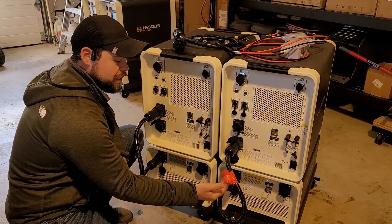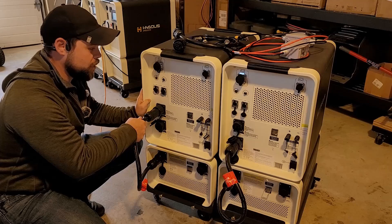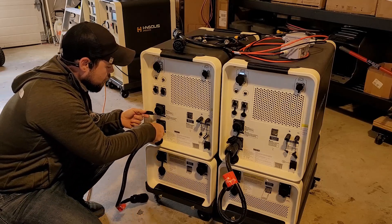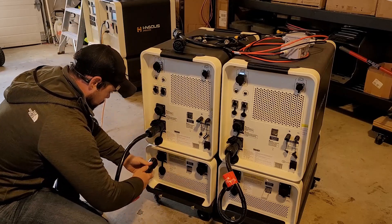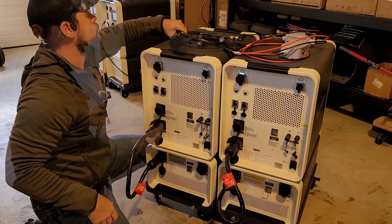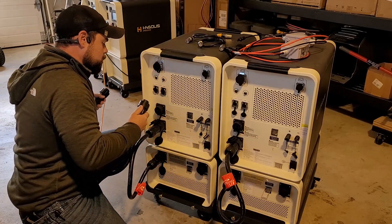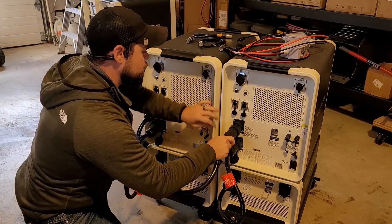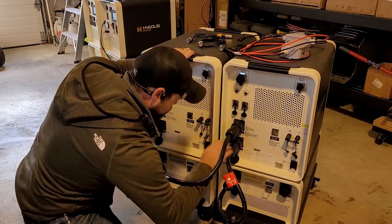I've got my battery cables which have the red tag. I'm going from battery port two to battery port one. On this unit which I previously had set up for single phase, I'm on battery port one, so I'll take those off and open up battery port two. Now I'm going to take my blue labeled cable — you can see this is an upside down smiley face — match it, push on, and twist lock. Both are now on; you can pull them and nothing comes out. Everything's very secure.